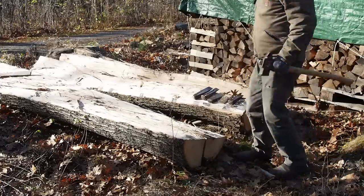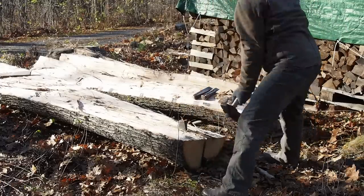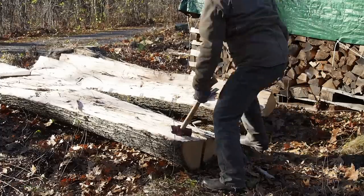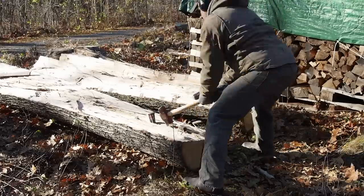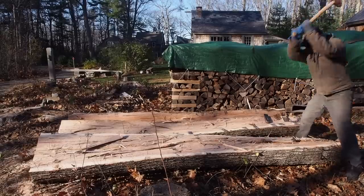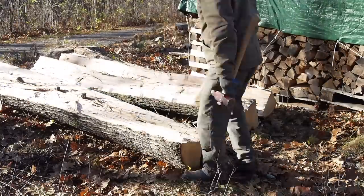Whatever you can do until you can get down to the point where you could actually physically pull and push on the wood enough to affect where that split will run, wedges are the way to go in keeping things in halves. If you do get off of doing things in halves, you're going to find yourself really struggling because two parts will, if they're uneven, one will always become a form of a spring. So you'll be pulling on one side, and the other side will just be staying straight, and it will just act like a spring. So you don't want to get into that situation.